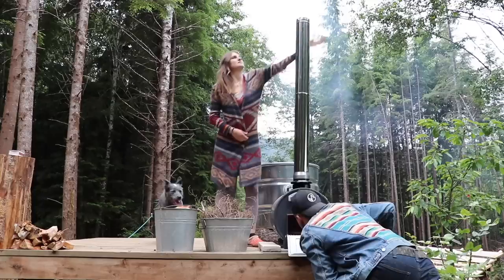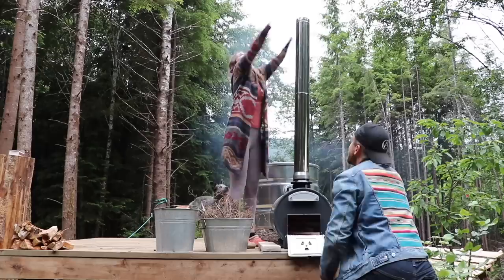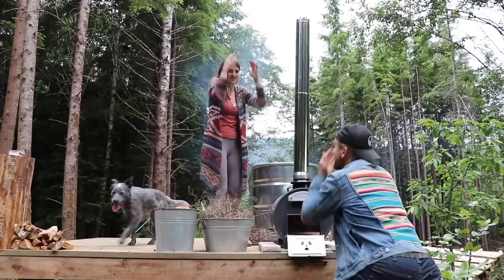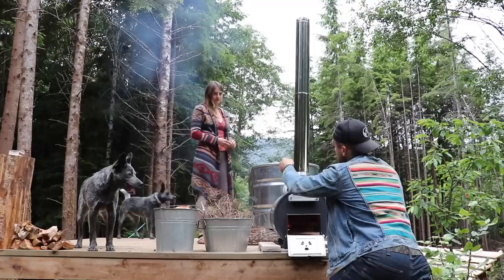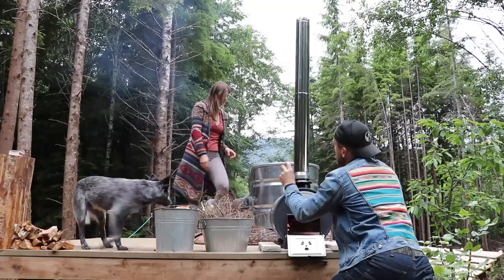Kind of, yeah. We need to build a roof over this just to trap the smoke. Tell me, is the water level above the second valve? Yeah. Nice. Okay. Yeah. Then as soon as the water in the wood stove, called the water jacket, once it's hot, then the hot water should flow out high and the cold water should pull in low.